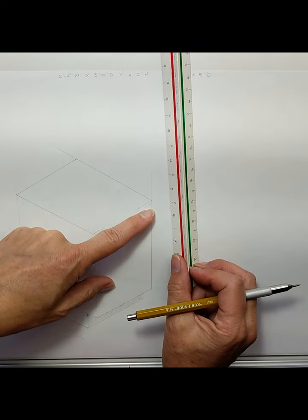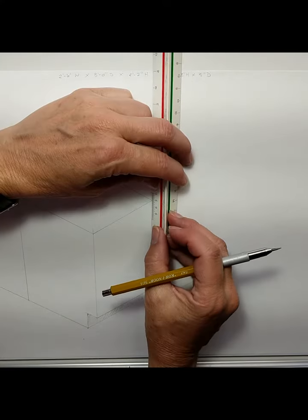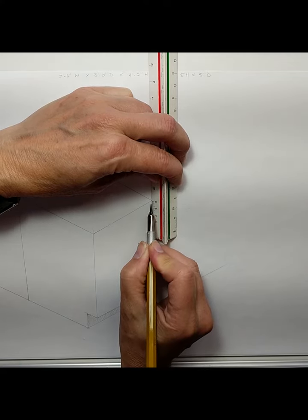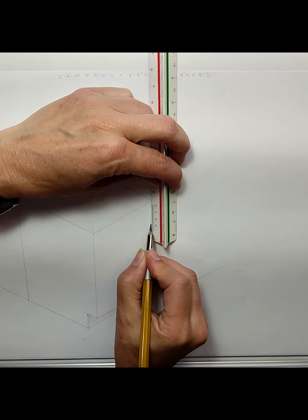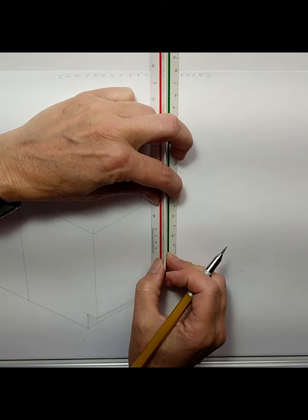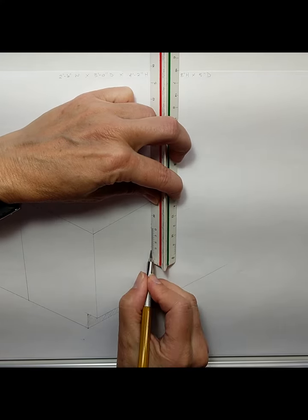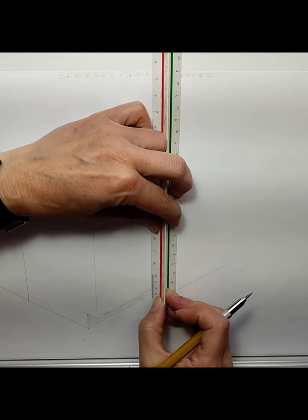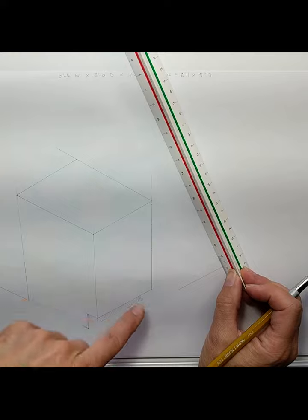So what I'm gonna do is along here, I'm gonna put a tick mark at the top and bottom of each drawer. So the gap at the top is 1.5 inches, and then there is a 9 inch drawer, and then another 1.5 inches of gap, and then a 9 inch drawer, and then 1.5 inches, and then we have 1 foot 6 for the bottom drawer, and we should have 1.5 inches, which we do, as the bottom gap.